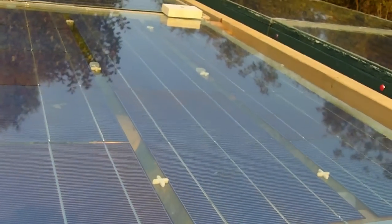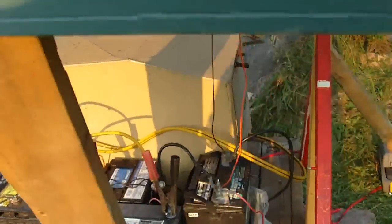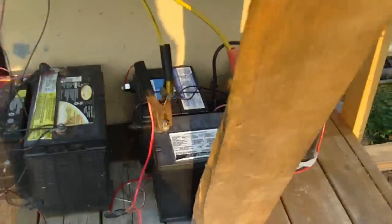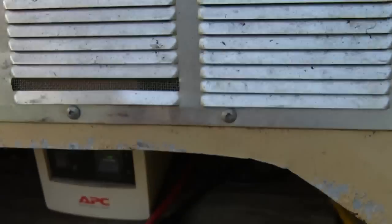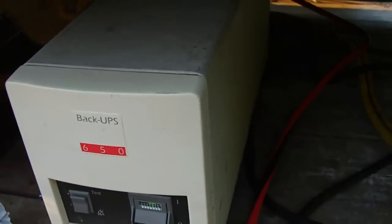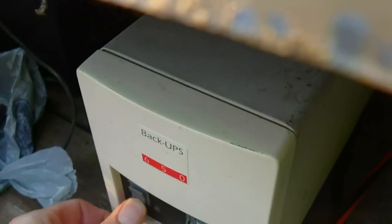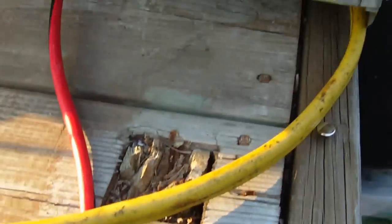It just holds on well enough to move around the property or to move it into position when the sun changes — throughout the year the sun's position changes, so you can just move this thing around. I've hooked up the batteries to the solar panels and also connected up an old UPS unit, which is just underneath this cover here. There's no internal battery in the unit. To turn it on you just flick the switch and press it down, and I've run this cord out into my garage.